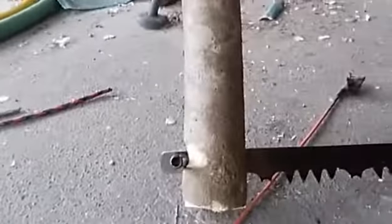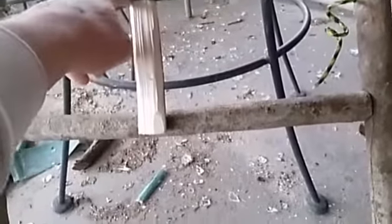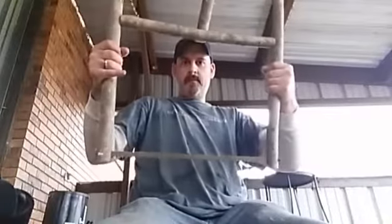But basically, what you got is you have your saw in the ends here, and then you have your center piece across basically the top midsection, and then you have your cord tied off and your piece that has twisted the cord, and you want the center piece, the brace, to be up high enough so that when you get through twisting, this piece here resides on it to keep it from slipping. And basically what you have now is a buck saw.